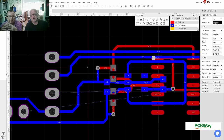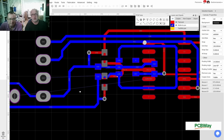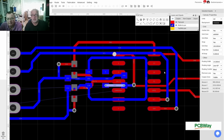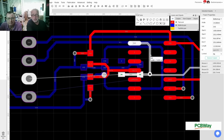If you think, isn't this a long line? No, this isn't a long line. And these I2C communications are pretty slow, so no worries there. So, do we have 3.3 volts somewhere on the top side? We do. Okay. Look here. Let me see, top side. Okay, we're a bit stuck here. About 3.3. Yeah, I'm looking for the pin over here at the display. I want to see how I can get 3.3 over here easiest.